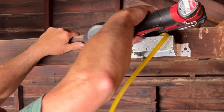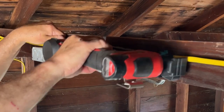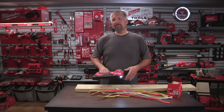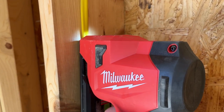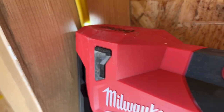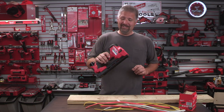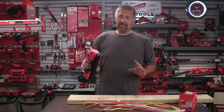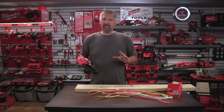The good thing is you can go a little faster and be more efficient, but the downside is this is a bulky stapler so it's hard to get into tight spots. If you have a 16-on-center wall you can easily get this in — that's fine. For attic work running cables across, it excels. But tight areas — not good at all. You're gonna end up shooting through a wire trying to get into a tight spot.